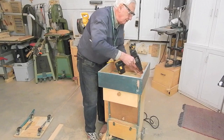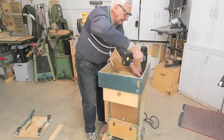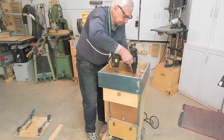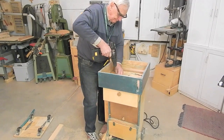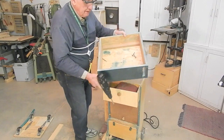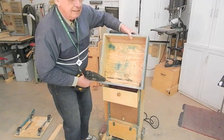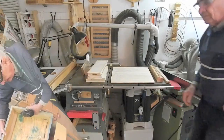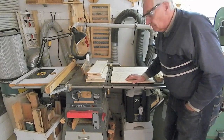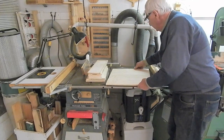This whole assembly is attached to the cabinet with screws extending down into the plywood sides. The front pivot block as well as the rear pivot block are visible on the inside. To build the retracting caster system for the double disc sander, I've cut out the basic pieces that form the base, the skirt, and the caster mounting piece.